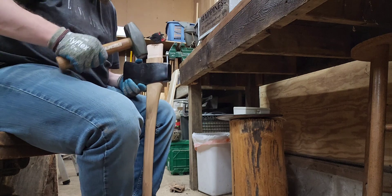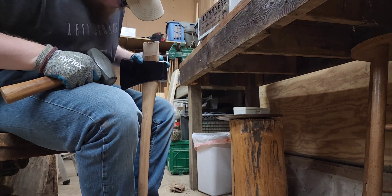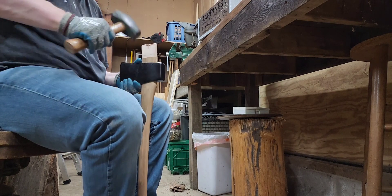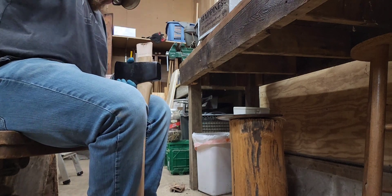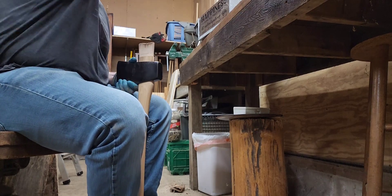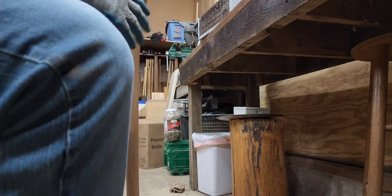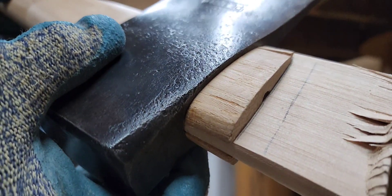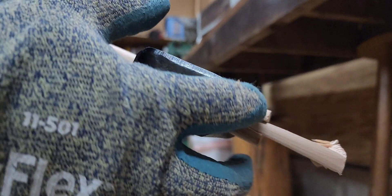If you use a heavy hammer, hopefully it'll get good enough pressure where it won't move. That's still making a little bit of progress, so keep at it. It looks like we stopped there. That's how far we are from bottoming out. This is some silver maple I'm using for the wedge — I really like using maple because it can take a really heavy beating. You can see the tongue has mushroomed out really nicely, splayed out — we've got good compression. I'm happy with it. I'll trim this off on the band saw and bring it back to the bench.